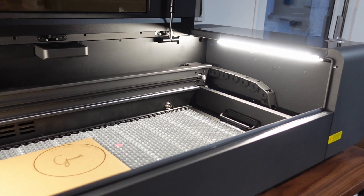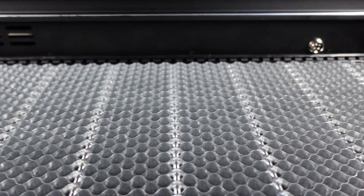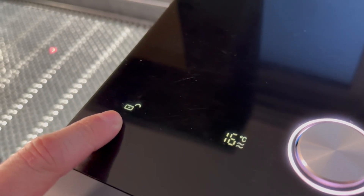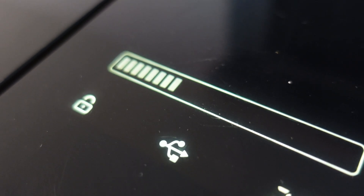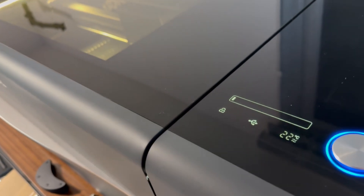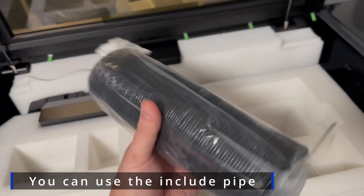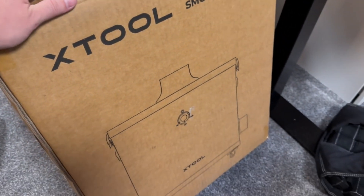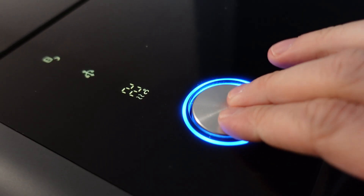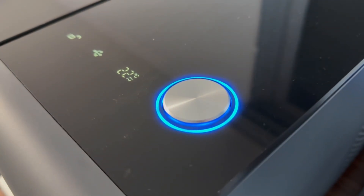Some quick specs for the P2: it features a usable bed size of approximately 26 by 12 inches and supports both slats and the honeycomb panel. It's got a small LED screen which shows job time, the temperature and also if the auto lock is engaged. By default when a job starts the auto lock engages so that the lid can't be opened whenever a job's running. The engraver features a 145 CFM exhaust fan which can be pumped straight outside, or you can opt to use an inline fan, vent it elsewhere, or attach a smoke purifier. There's an emergency stop button, a rear power switch, and a physical job start button which also doubles as a pause button — double pressing it will repeat whatever the last job was.